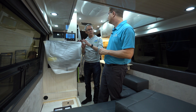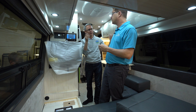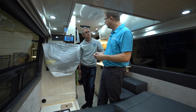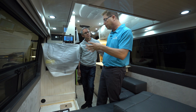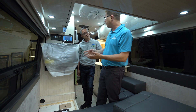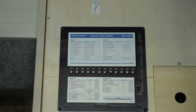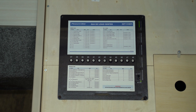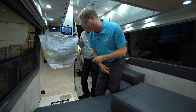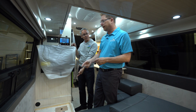Before multiplex wiring, if there were a problem you'd literally start tracing wires to find a short or dead connection, involving removing cabinets and walls and digging in. Now with fewer wires, if there ever is an issue it's usually something easy to fix. We have our DC load center here — most of the 12-volt breakers are resettable, so if it trips it'll just reload itself. We also have manual ones: if it trips, you know exactly which one it is, push it back down and away you go. It would also show up on the touchscreen, so you can check both places.